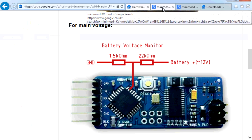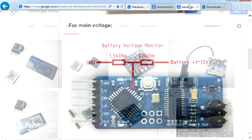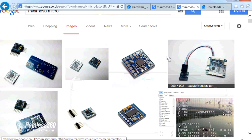Now we've covered that, let's go onto the bench. If you want to know more about these other videos I'll put links in the description. I would say that in terms of all the wiring, the wiring is identical whether you're using one of the older boards or the new micro board — the pins are almost identical so you just have to follow the wiring diagram. I'll put a couple of slides up to show you how to connect it. So let me show you how small this thing is in real life and go through what each of the pins do around the outside.